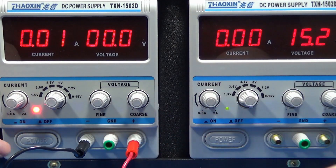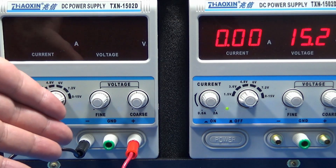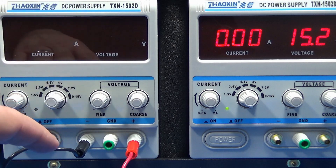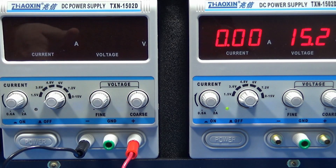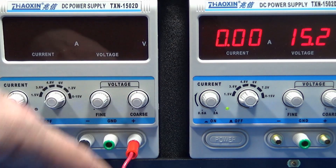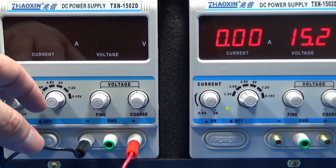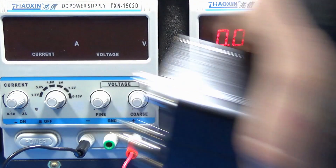For example, the people who repair smartphones need to give current to a short circuit to find out where in the smartphone, tablet, or laptop the short circuit is by finding the temperature change. They need a true current limit for this. This power supply is good to charge batteries, but it's not good to find short circuits — this accessory is what we need for it.